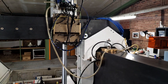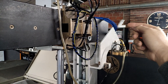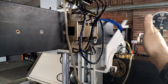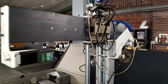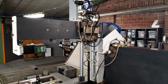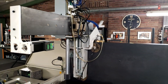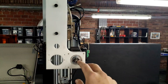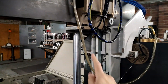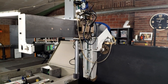I just don't seem to find a way where everything fits. I do have some constraints: the linear forces are being put into this piece, I want it to be somewhere in the middle, I don't want it to stick out too much and create leverage, and I don't want too much weight up front. One option I was playing with was to have the motor mounted in here with a belt transmission running to the ball screw up top, and basically attach the ball nut down here — which was kind of the setup I had last time, but with the motor sticking out, which I didn't want anymore.